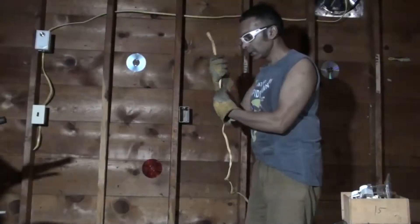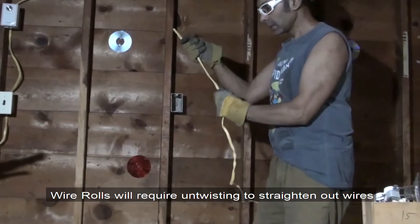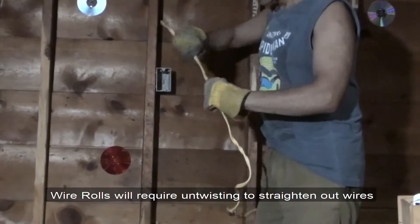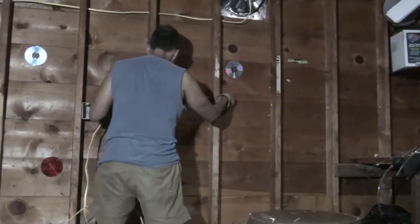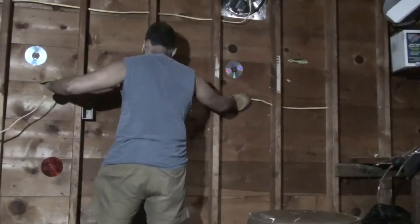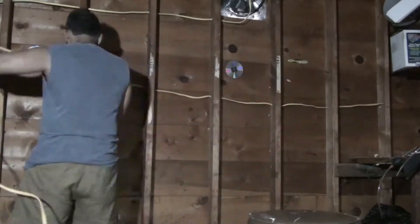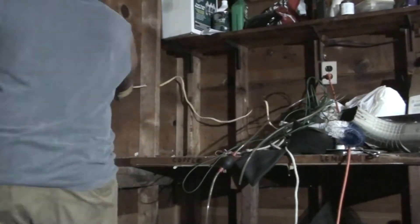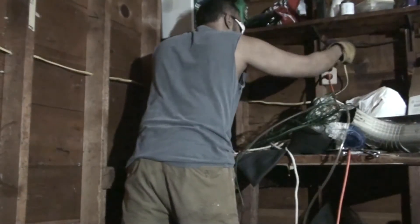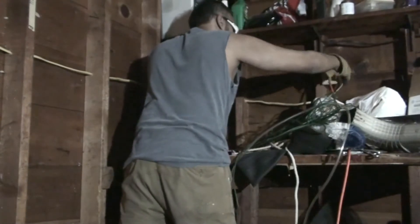You see the opening I made — it's pretty small, just enough for a wire to go through. You make it too large and the box becomes useless and you have to replace it. I'm going to have to untwist and straighten out this wire as it comes from the reel. I think there's enough to go in here and come out — you need at least three inches sticking out.